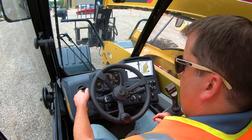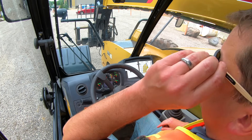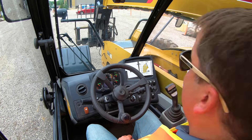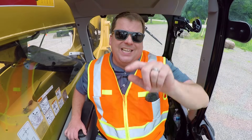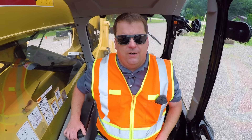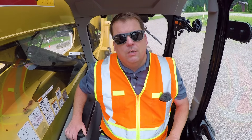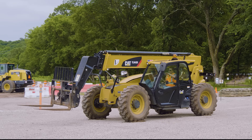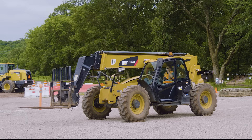The shifter is here — my speed settings: I've got forward, neutral, reverse, and the shifter gives my speed setting on the dash. The final piece is the angle of the machine — I've got two switches on this CAT that I can adjust to make it level. There's a level indicator on the left. This will actually adjust it up to 10 degrees left or right. You always want to make sure you're level before loading anything.